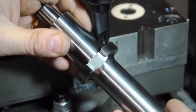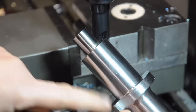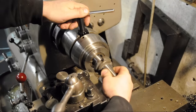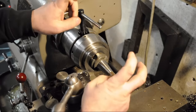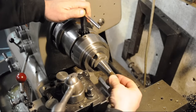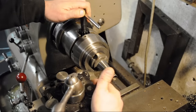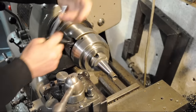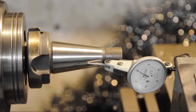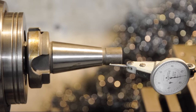All right, I just deburred a bit with a file and I think that should do it. That's all of them cut. Let's go back to the lathe and cut the taper. My top slide has been set up for this taper since I made the first prototype tool holder. Since then I've taken some really heavy cuts, so I'm going to put in my good tooling — the tooling I've been copying — and verify that the top slide is still set to cut that same taper. Nothing's moved, basically. So that looks like it's still good. Nothing left to do but cut them.